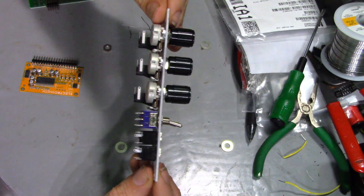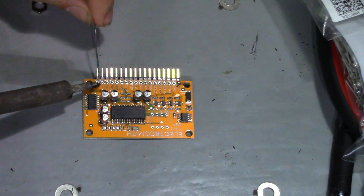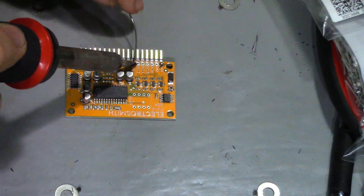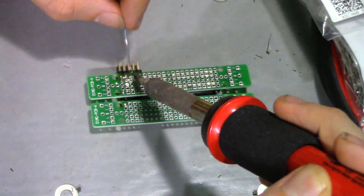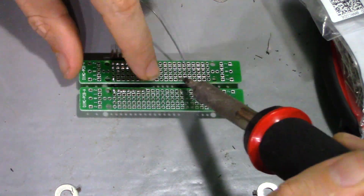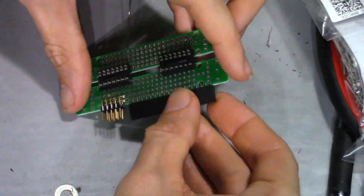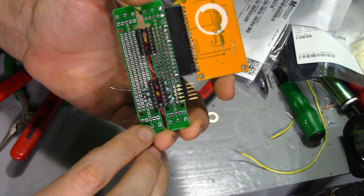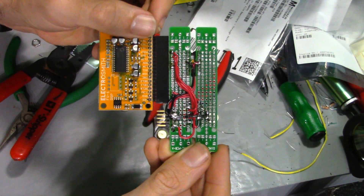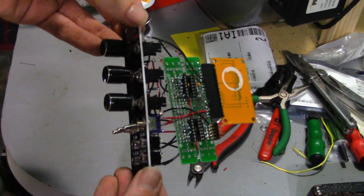With all the hardware mounted, I started the wiring by soldering in the included pin header to the DSP circuit board. Then I mounted two chip sockets on some perfboard strips, then a socket for the DSP board and the power connector. The wiring for the audio in and out looks like this. The wiring for the control voltage looks like this. Here's the pre-wiring for the faceplate and the final wiring with everything assembled.